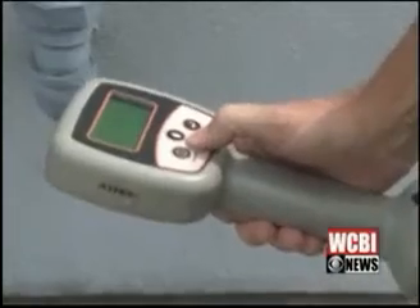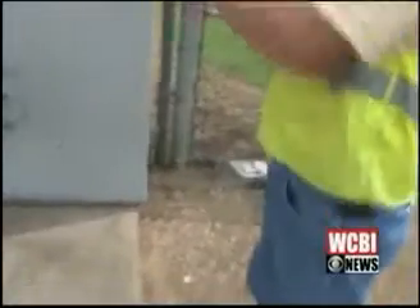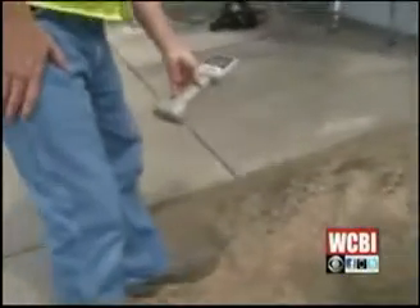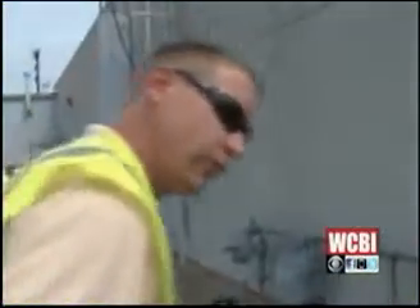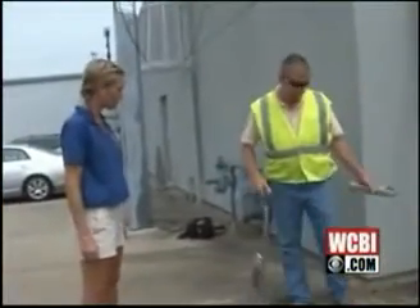It can probably see down to about 15 feet below ground. Your service line running up to houses can be anywhere from 18 to 24 inches deep. All we do to locate the line is turn the transmitter on — it puts a radio signal on the gas line, the receiver picks it up. You work the machine back and forth across the ground, and when you come to a peak reading — when that sound gets its highest, loudest tone — that's the one you want. All your gas lines are marked with yellow paint.